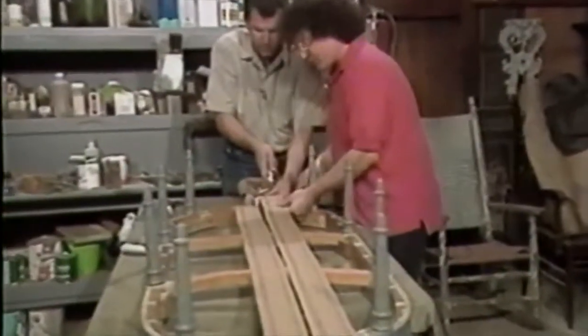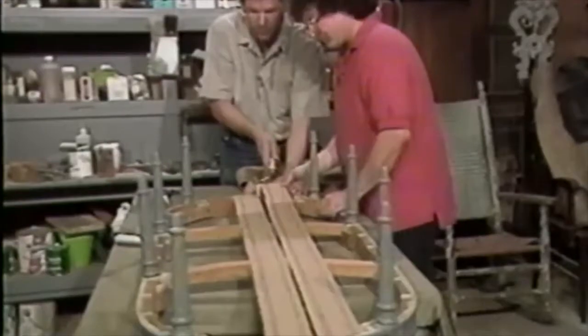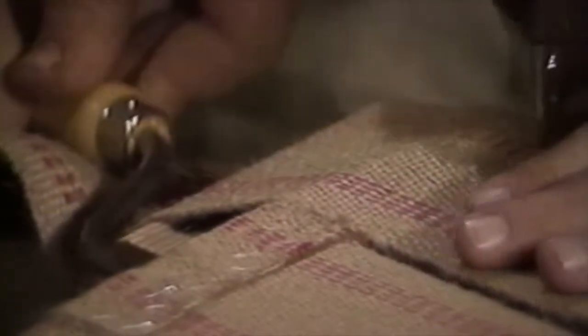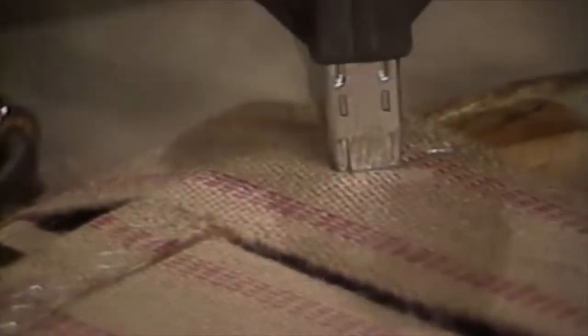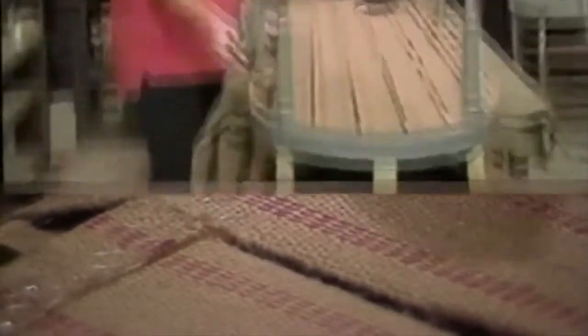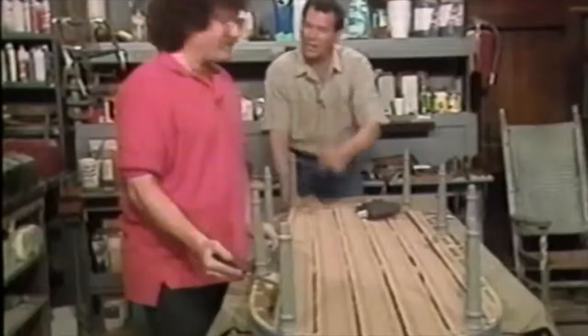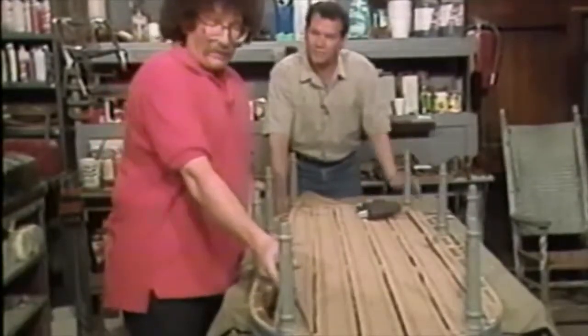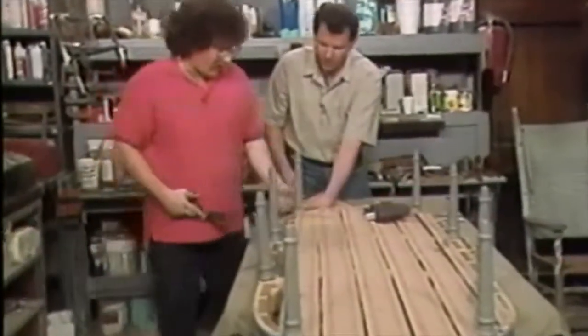Make sure that gap is straight, spike through, and pull down. Now we've reached a leg. What kind of legs are these? These are patterned after Louis the Sixteenth's — he had funny legs. We have to cut around this leg. A little snip here, a little snip there. Fold it over and tack both sides. Do the same down here.